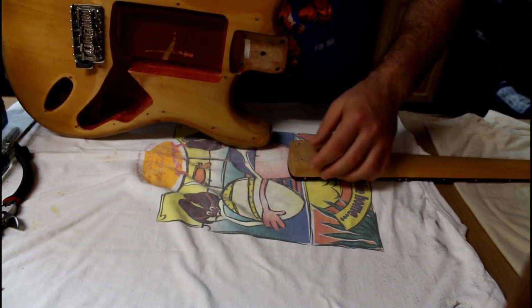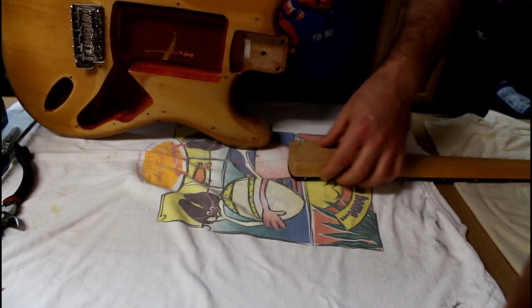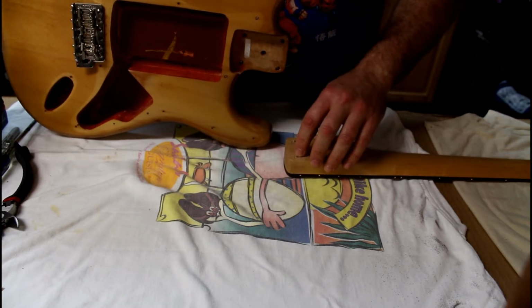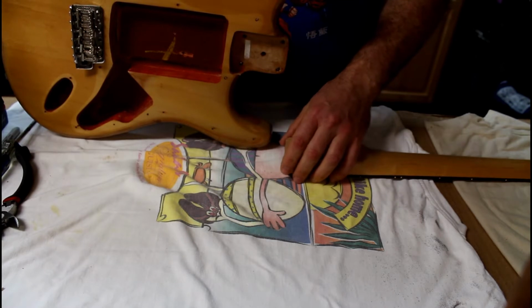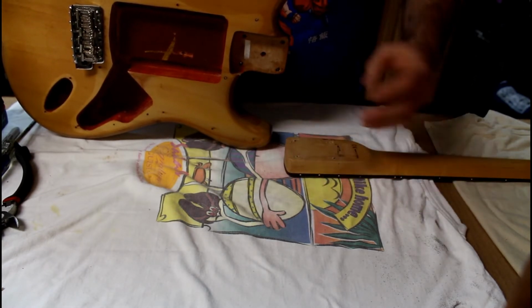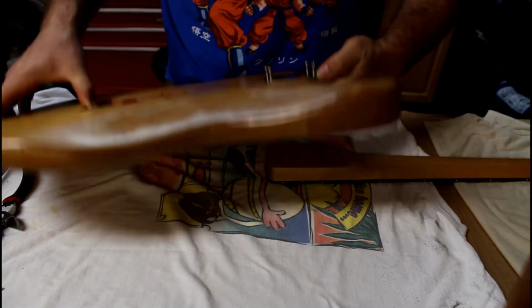And you don't necessarily want to do that without a guide hole, because you'll crack the wood anytime you put a screw in a piece of wood and you don't leave a little bit of relief in the hole there. Eventually the wood has to kind of move out of the way to accommodate the screw, and it usually cracks down the grain. So we've got pre-drilled holes in there, and hopefully everything's going to line up perfectly.